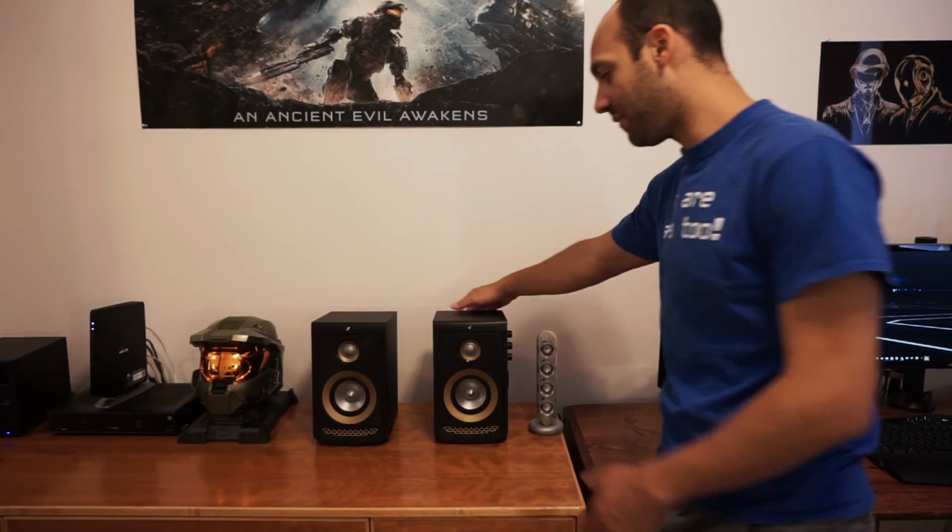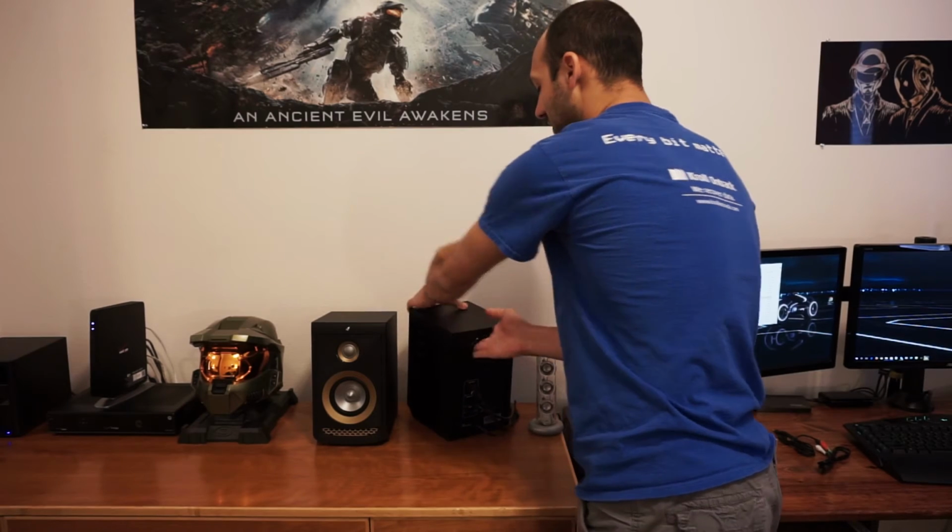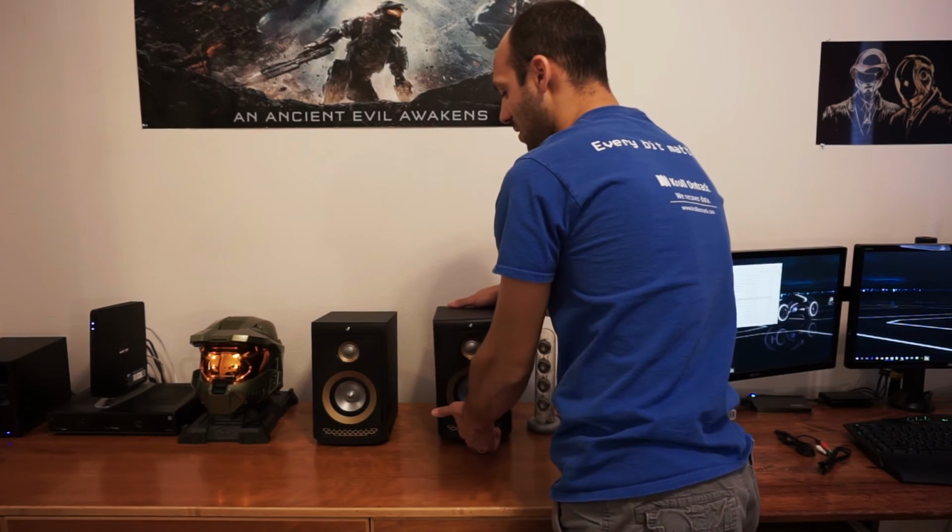So on this next part, I'm going to leave these playing, turn these on while it's playing, and you're going to immediately notice, even though these have excellent highs and good bass frequencies because of the sub, the vocals are lacking that warmth. It's almost tinny and lifeless, and that's just because the driver size. So I want to showcase the importance of having a nice size woofer for your mid frequencies, and this is a ported enclosure, so that's going to get the most out of those frequencies without sounding too artificial.